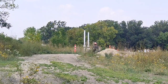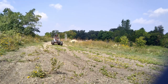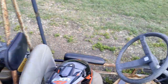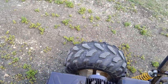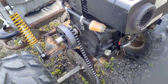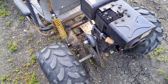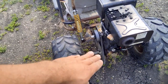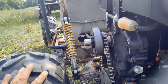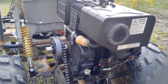The thing runs and drives but it's geared way too high — I think it'd probably do like 90 on the highway. So the plan now is to get it lower, put a jackshaft off the back. This is a 14-tooth clutch up here — it's way too high. We're going to run a jackshaft off the back where the engine plate is.